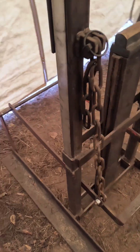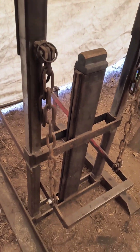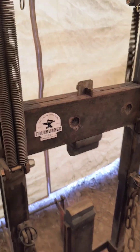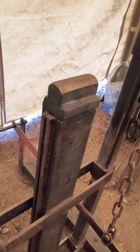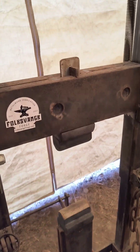We have two sets of rails on either side — just two-by-two, quarter-inch-thick square tubing that goes all the way up and creates the entire frame. We have a couple bars stretching across that keep the anvil directly in the center of those two rails and keep everything aligned. The head of the hammer — if you look at the top — is just a bunch of flat plates welded together with a little gap in between that accepts a two-inch by quarter-inch shank, wedged in so the die stays in place. Same thing with the bottom: the anvil is made of flat plates welded together and the die has a matching shank accepted into that slot. Rather than using a big block with bolts, I use a wedge system — it's simpler, easier to take on and off, and only needs a hammer to knock the wedge out.